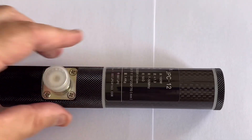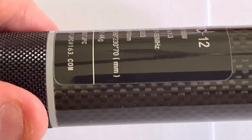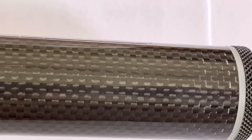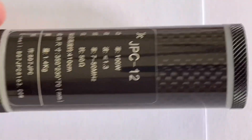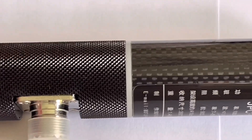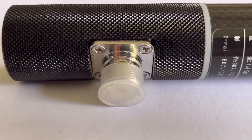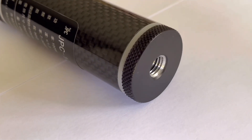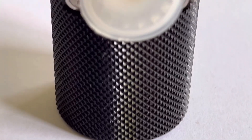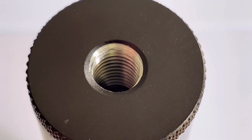Taking a close look at individual components that I didn't get a close look at in other YouTube videos about this antenna. This is really high quality knurled aluminium, with real carbon fibre sleeving and press-fit nylon in between — remembering that everything has to be insulated. The core and sheath of the coax and the SO-239 connector at the bottom always have to be electrically isolated, so you can't make just one chunk of aluminium. If you turn the top against the base of this component too much, you can actually undo it and the nylon sleeving will come apart. Prior versions used plain PVC tube instead of carbon fibre, so there have been revisions to both this component and the coil.